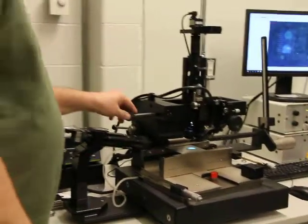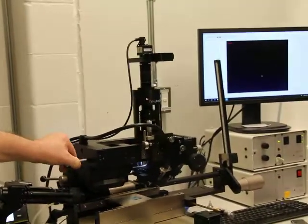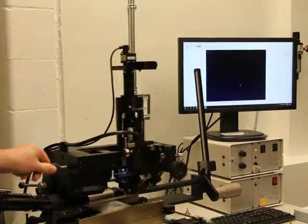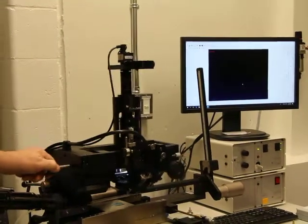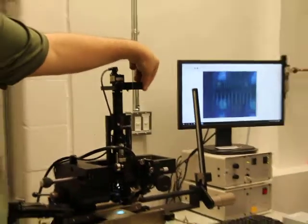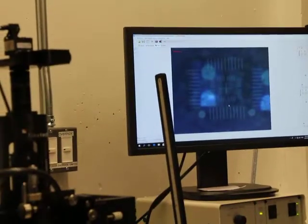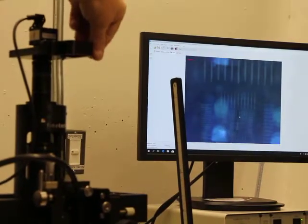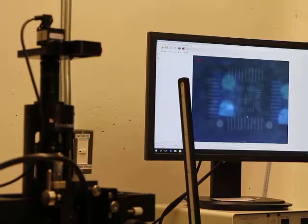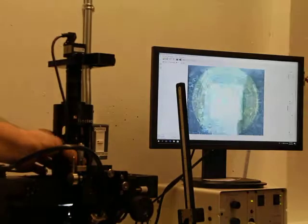Let's see, so this right here is our optic tower. Basically it moves back and forth. Whenever you move this tower, you want to use this handle and just push it all the way, and then you can bring it back. On top of the optic tower we have a Y shifter, so if you had parts that were bigger than the field of view and you zoomed in and needed to see just a little bit more, this kind of cheats in the Y direction a little bit for the optics. Also, we have the zoom here, so you can zoom in and all the way out.